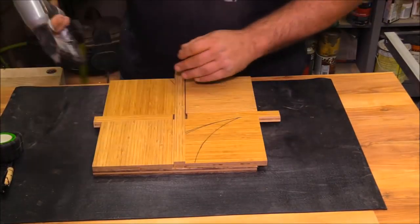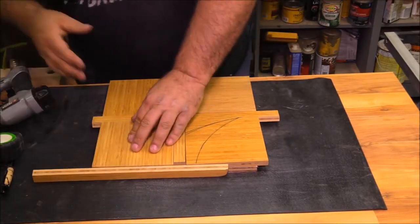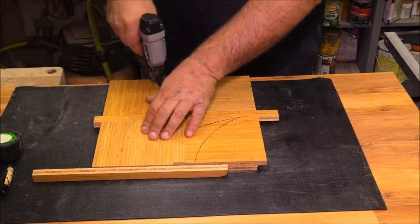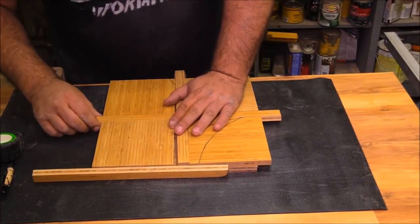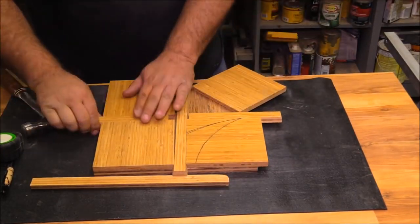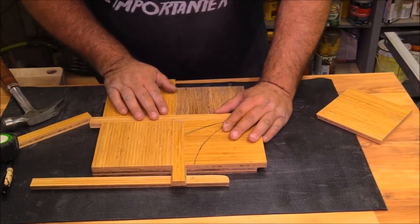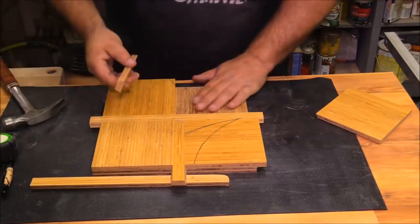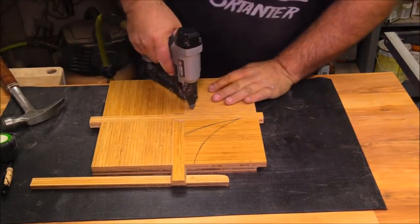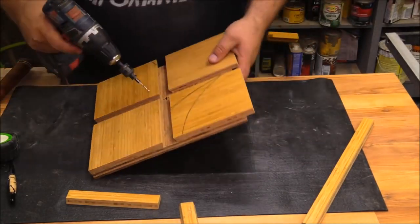This is really the most important part of the build. You want to make sure that those guide rails or slides are nice and snug between the blocks — not so tight that you can't move them, but not so loose that they wiggle back and forth in their slots. To make sure everything was tight I cut extra rails, pushed the blocks up against each one, made sure they were true and snug, and then I'm just tacking everything down with a 23-gauge brad nailer.